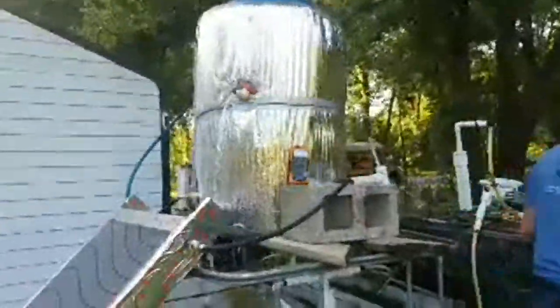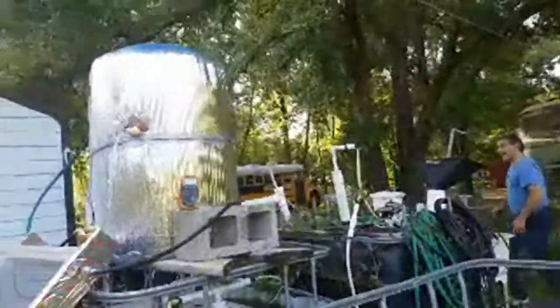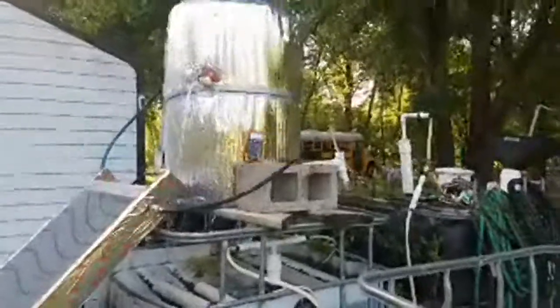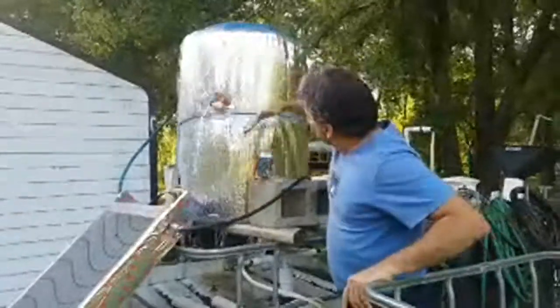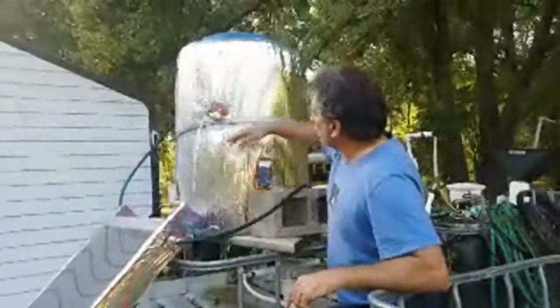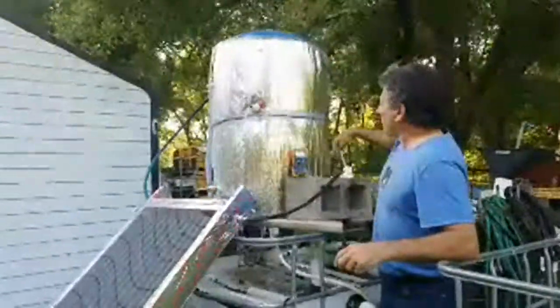Let's see that. So I'm going to turn on the water. Oh, the water is on. Okay. So what's going to happen is the toilet float that's in here, there's a float valve. As the water level gets down lower, the float valve is going to go down, letting cold water into a pipe that goes down, starts at the top where the float valve is, goes down to the bottom, and then adds the cold water up. I should insulate that pipe because there also cold is being transmitted, or rather sucking heat out as the cold water goes down the pipe.